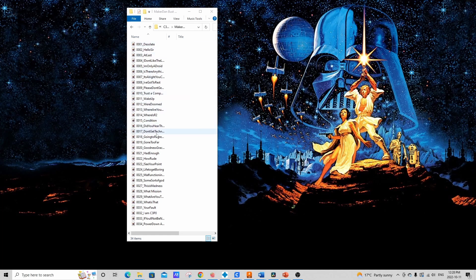When I shut him off I don't want him looking in a weird direction, so I programmed it so that when you hit the power-down button he plays the power-down sound effect once, then says 'If you'll not be needing me, I'm going to power down.' His eyes shut off, his head moves to the center position so he's looking right at you, and then he's inactive for about 10 to 15 seconds. In that time you just shut off the switch and he's ready for next time. Otherwise he'll reactivate and start going through the clips again. I'm going to make these available once I'm done setting everything up, probably in the next video.